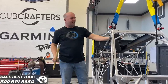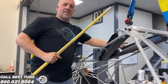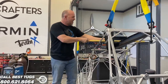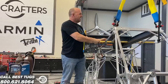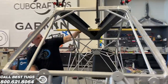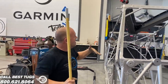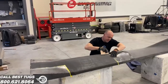This part's just about done — strapped to the parachute. This needed lots of angled cuts through this carbon fiber part for the flap handle. I used sticky sandpaper on a bar — I cut this track an eighth inch too small so it's at all these different angles and heights, then I worked my way down. Now it's done, and that is as straight as you're going to get for the flap handle pass-through. When the flap handle bar goes in there, all the straps will go on top of it, and when the chute pulls, it's all lapped over the top of the flap handle. That's ready to go.